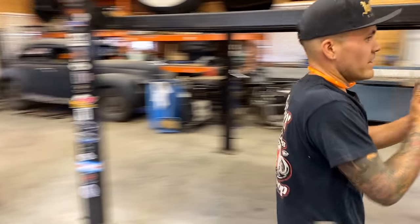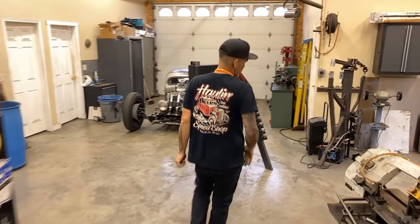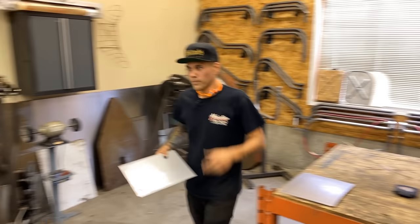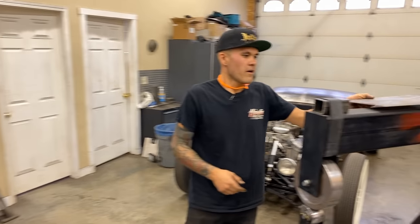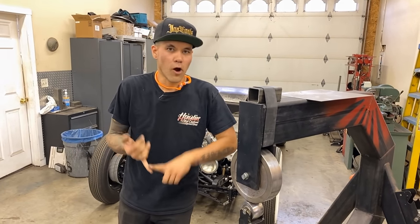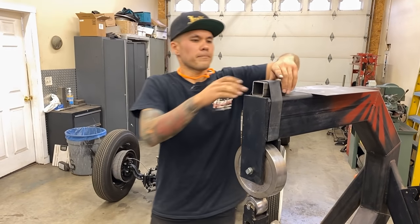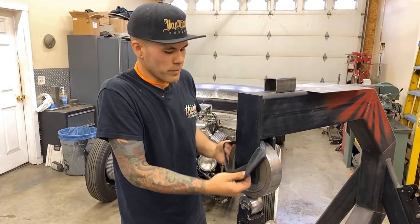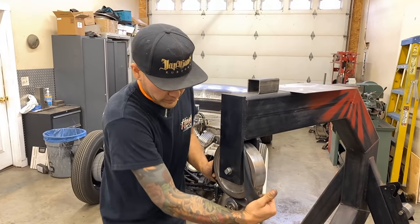All right. That is the basics of planishing with the wheel. Now I would like to show you the form so that we can put a roll into it. I recently used this on a repair where it was a pretty flat panel on the side of a vehicle. We're talking about rockers on something, you know, maybe a truck or a van, that kind of thing. And where you basically want to just get a roll in a piece of metal.